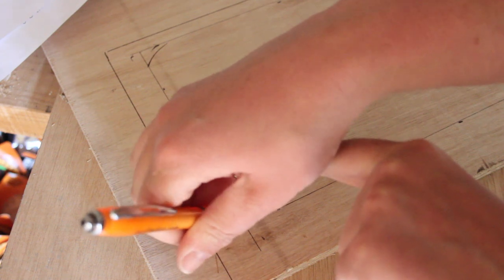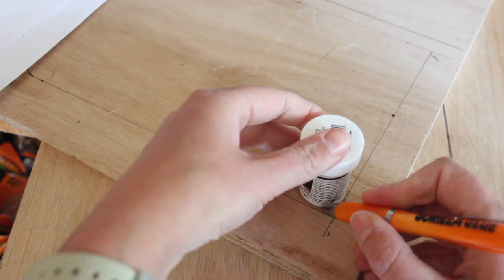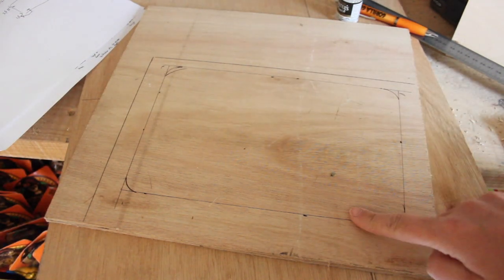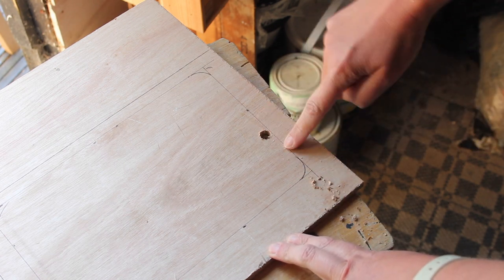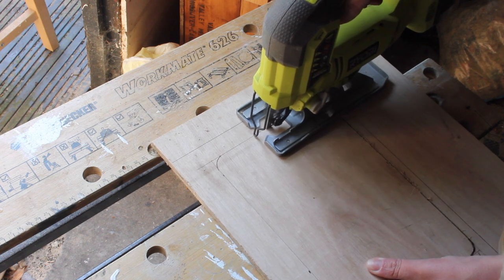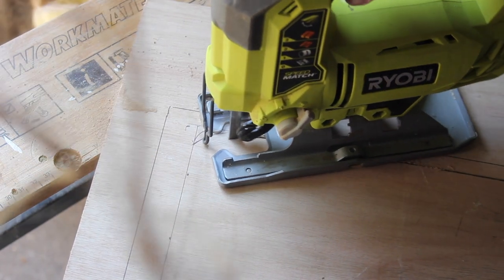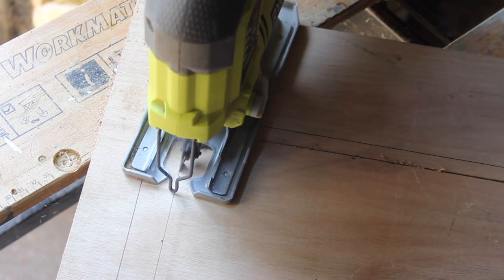What we're gonna do is — I found a nice little tester pot of paint, line it up with both lines you just drew, and you're gonna follow the curve just to get a nice rounded edge on your plywood. Here we have the 9 millimeter thick plywood with the shape we're gonna cut out. I'm just gonna drill a hole close to one of the sides so I can put my jigsaw in and cut this bit of timber out. It will be very tricky to cut out these rounded edges in one go, so I just make a straighter line for my jigsaw, and once the middle rectangle bit is cut out, I go back into these rounded edges.